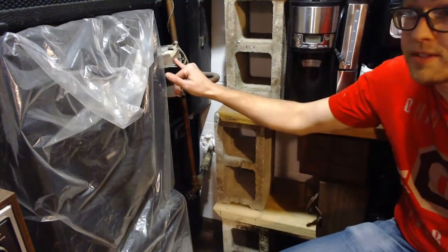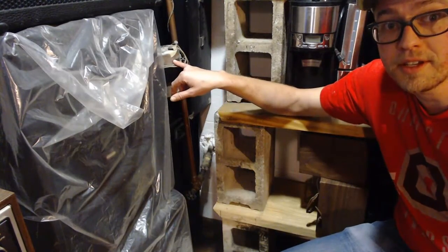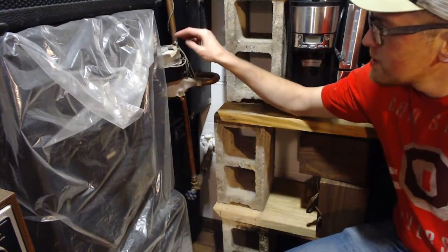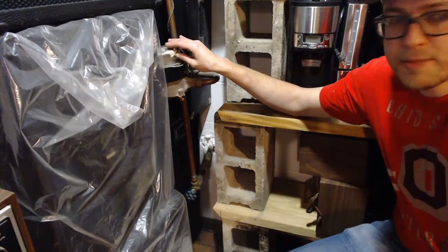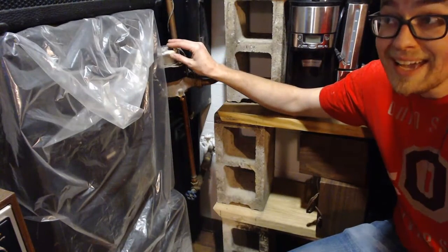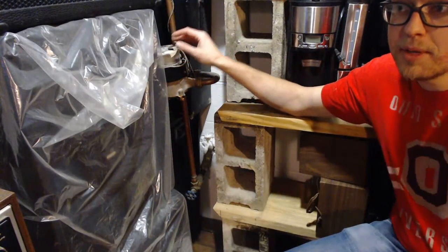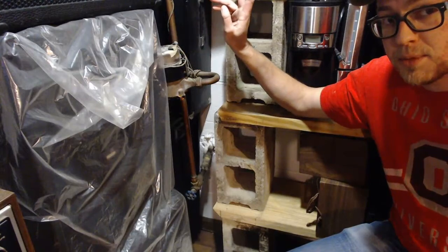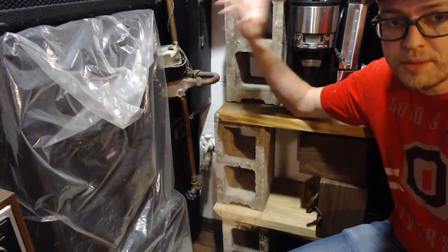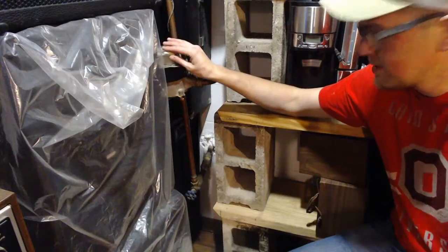So this is the water meter that we were just discussing in one of my previous videos, right? A lot more accuracy on this meter than the meter outside. One point I wanted to reiterate was the reason we have an inside meter is to double check and make sure that both of our meters are giving the same reading and there's no water loss happening somehow, like a leaky pipe in between the outside meter and the inside meter.